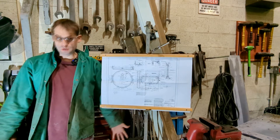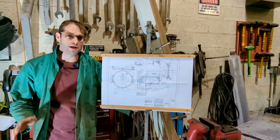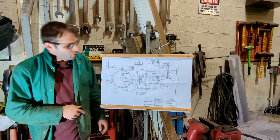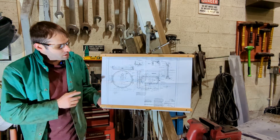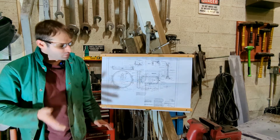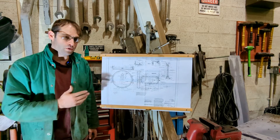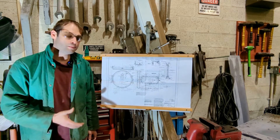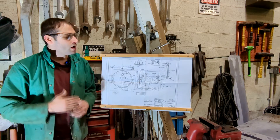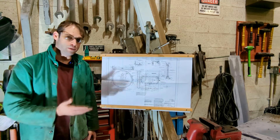One of the benefits of working at a museum where we have archives is that sometimes we have access to documents that tremendously help us in our restoration efforts. Here we were able to pull up an original drawing of one of these Golden Glow headlights dating from around 1920. It gives us all the information we need to reproduce them, and I'm going to walk through what dimensions I'm looking for to help me project this out, roll the barrel, and find the lines, widths, and heights of metal needed to reproduce it.